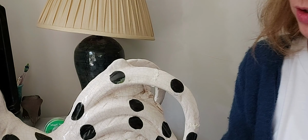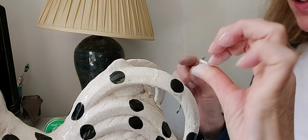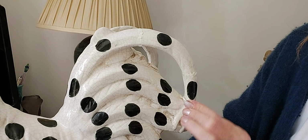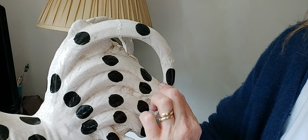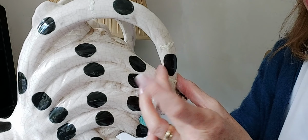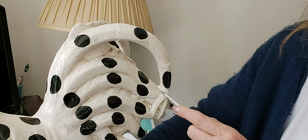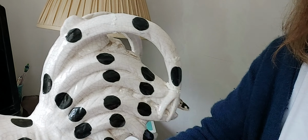If you wanted to, you could always, for instance, make a slight sausage shape if you find that easier. You could make a sausage shape here and work alongside the crack and gently press it in with our finger, which is actually working quite well on this. You don't always need the tool, or you could use the tool to flatten it off so it's not too straight. And you want to blend some onto your original here, ready for sanding.